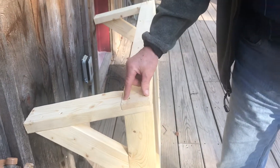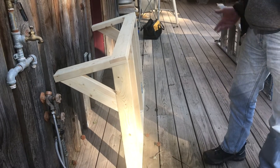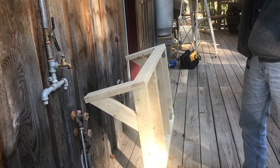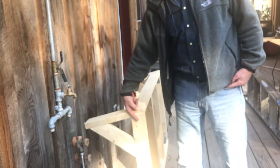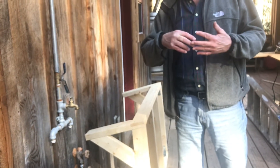The rest of them are just screwed-in joints, and then there are galvanized brackets in the corners. I think that will be adequately strong to hold everything together for a good many years. Everything is put together with screws, and one of the things we tried to do as much as we could is get screws so they don't just screw straight into the end grain. So these screws are all angled so it's kind of halfway cross-grain, because screws into end grain don't work very well. If you take screws into end grain, really what it does is just chop up the grain and you can just pull the whole thing out.